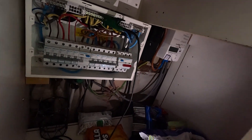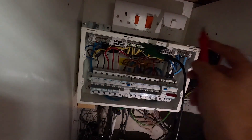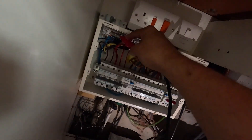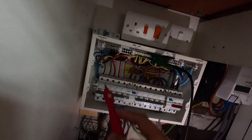A little cheat - make sure your lights are on before you test, so you've got all the loads on, because it could be something that only becomes an issue when it powers up. With all MCBs off, the RCD off, and main switch off - the neutral is not connected to earth over here. On a TN-C-S or TN-S system, with that main switch off it disconnects the neutral-to-earth link, so we can test from the earth bar to neutral. We're getting 4 meg - well over 1. But testing earth-to-line we get 0.00, so there's definitely an issue from one of the circuits we've just pulled out.